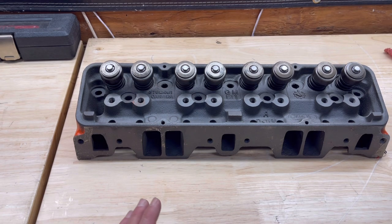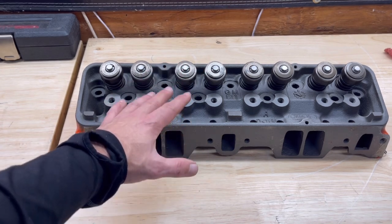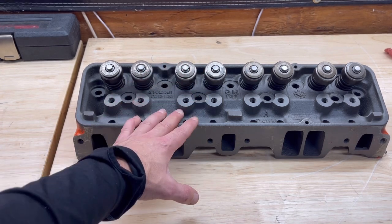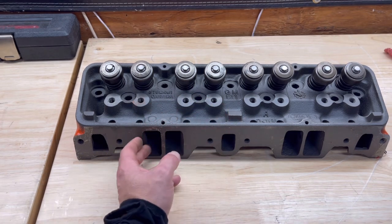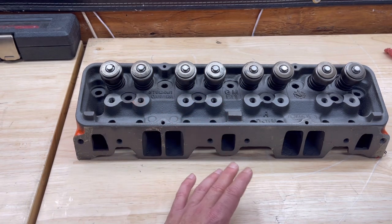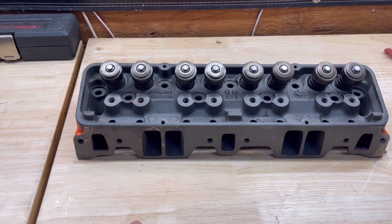This tool works with aluminum, copper, brass, and all that type of stuff. I'm pretty excited because I've always wanted one of these. I've been playing around with it and I can tell you right now it's really going to help me determine how much I can take out — whether my engine blocks have core shift that's affected the walls too much, or how much I have in there to make sure it's a good engine block I can build safely and have a whole lot of fun.